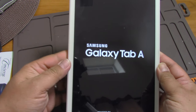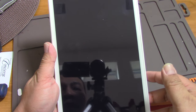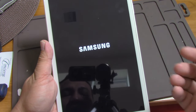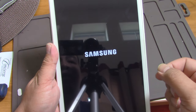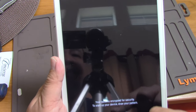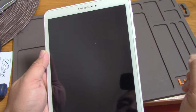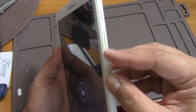There you go. Actually, this is the second time I'm powering it up — the first time it wouldn't power up, the screen was still dead. So I opened it up again and disconnected the battery cable. There are just three cables so you won't miss it. Disconnect the battery cable, put it back in, and put the cover back because you need access to the buttons.